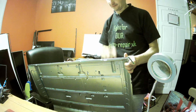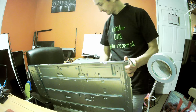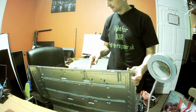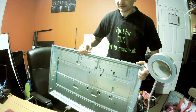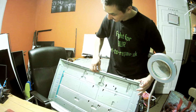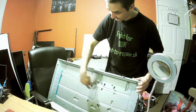So what would you check now? Well, I know for a fact that there was an issue with those LEDs. But we know that this is red blinking right now. So what I could test is if the voltage is coming into these strips. Because if the voltage is coming in, that means there is an additional problem with these. So that's what I need to do. I'll also check which one caused the trouble, because maybe only one of them is causing the trouble and the rest are fine. So I'll be right back.